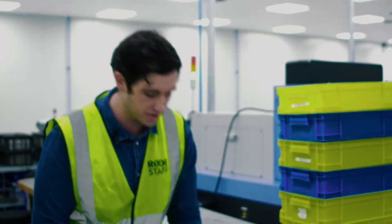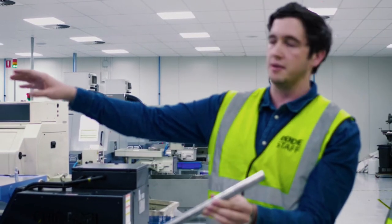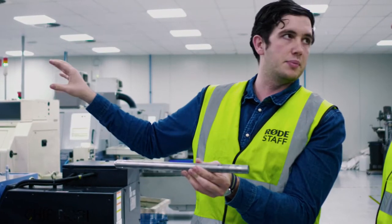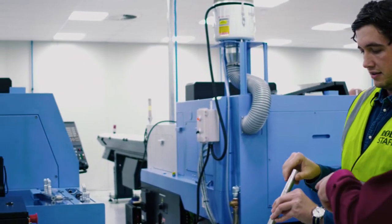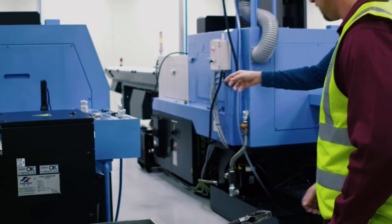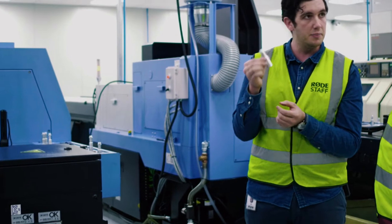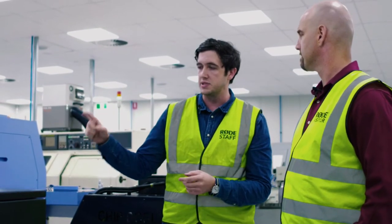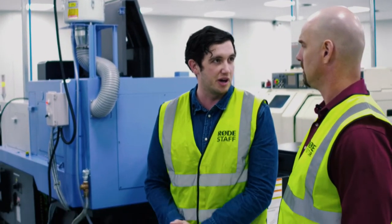Here's the kind of material that goes into the machine — a solid bar — and then we remove material using this machine. The bars are about three meters long. We set these up and they can run 24 hours a day; you load in a whole bunch of bars and they just keep running, producing microphone bodies or whatever part they're making. It entirely depends on the product and complexity — some parts might take up to 12 minutes in the machine, others are done in a few seconds. Machining time can actually be one of the big bottlenecks in manufacturing.